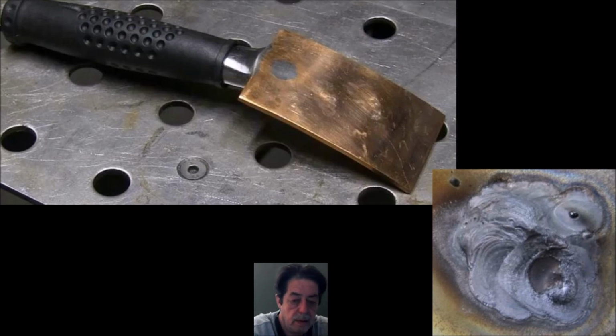Yeah, I can summarize some of this. If you're doing this and you're having issues, I really believe a high percentage of the time you're not letting those tack welds cool down enough. It doesn't matter exactly how long. I just pause, wait a minute or two, go to the left, wait a minute or two, and then go to the top. You've got to give it time to cool down. Sometimes on that final hole sealing, when it gets real small and I'm ready to seal it, I go back and forth over it and give it a little bit of thickness, because I'm not worried about it; I can take it down fast with a flap wheel.